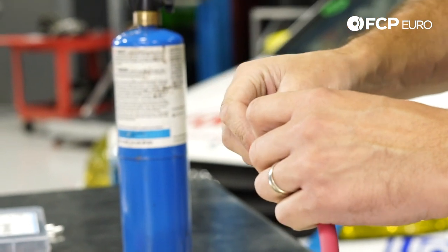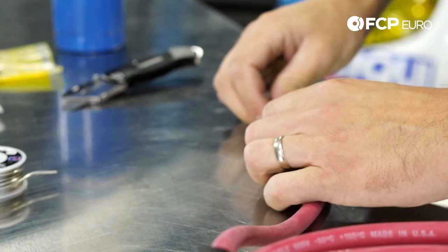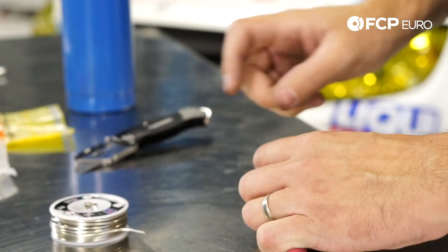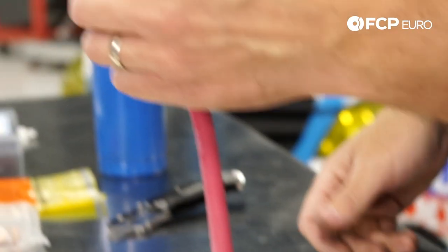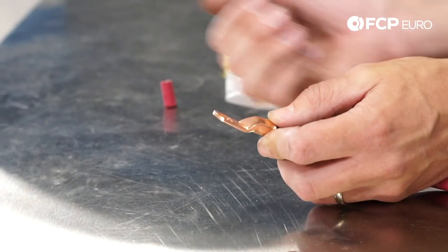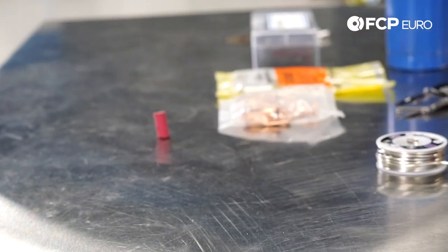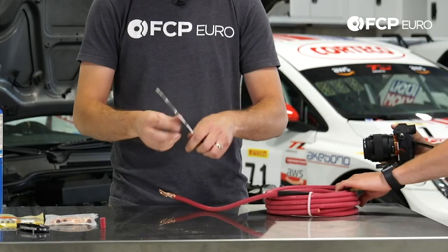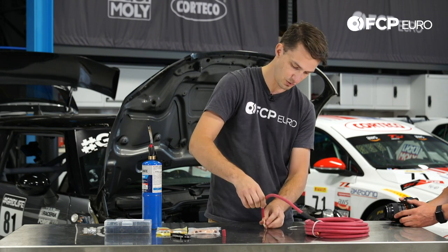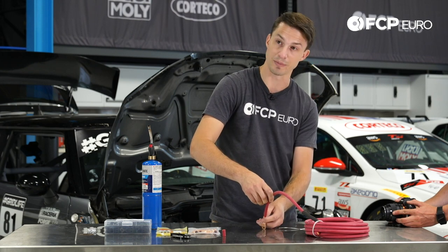We're going to heat this up and then put some solder in here to create the seal we want, to make sure this doesn't come disconnected. When I do this, I like to focus the heat right in this section because we want the solder to be pulled through and the solder is going to go to the hottest portion. So we focus the heat right here, it will pull the solder in and we should be all set. Get a nice length of solder out so you don't burn your fingers while you're doing it. I'm going to bend this cable up a little bit so I can use the stainless steel table here to hold it in place, and then I can feed the solder in so I don't burn my fingers in the process.